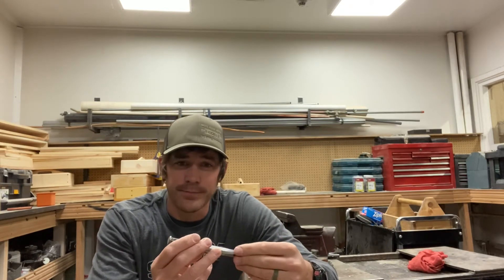Moving on to our next topic — specifically these chisels. These cold chisels we may use for chipping off any kind of spatter from a weld that we've made, or possibly cleaning up metal from a plasma cut when we're working off any kind of slag.